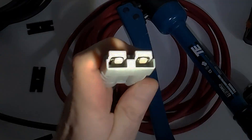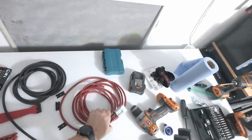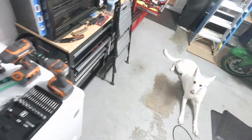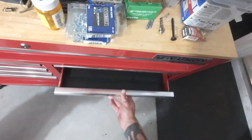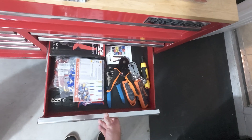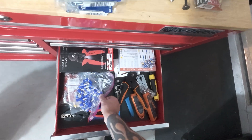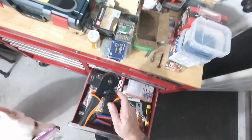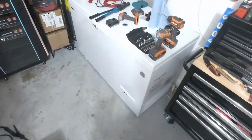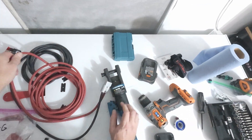That's what it looks like inside of there. These are nice, strong, high amperage connectors — this one's rated for 50 amps and we're using six gauge wire. Let's do the other side of this cable as well. It's going to be a general purpose cable, especially because it's six gauge. I'm not going to put an XT60 connector or anything crazy like that on there.